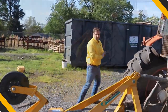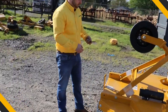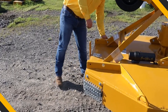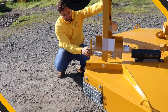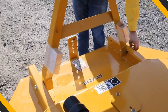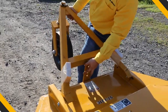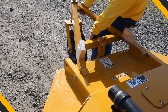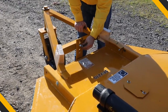Now you're ready to pick up the mower. Once you have the mower picked up, you'll come back to the back of the unit. There will be a bolt in this arm right here — remove it and pull down your trail wheel arm. There are different settings on here depending on how high you want to cut. For setup purposes, I'm going to put it in the second hole. Once you get it in that second hole, put on your nut and tighten it down.